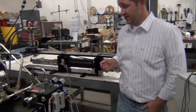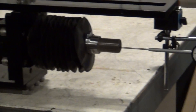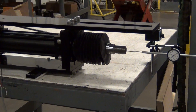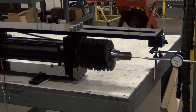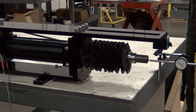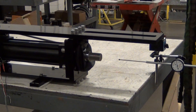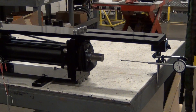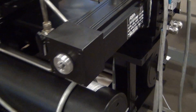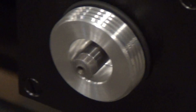We can demonstrate that function here. Focus on the cylinder — I will kill electrical power to the actuator. This one is a fail retract, so I'll go to the fully extended position and then kill power, quickly closing your steam valves. When you reapply your signal or power, the motor and pump automatically recharge the accumulator and the unit goes back into normal operation.